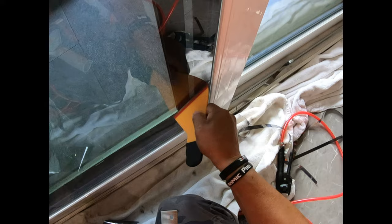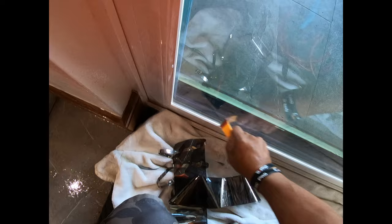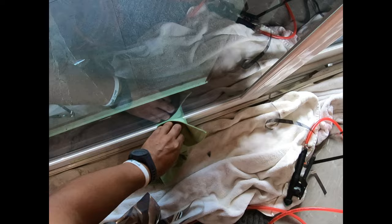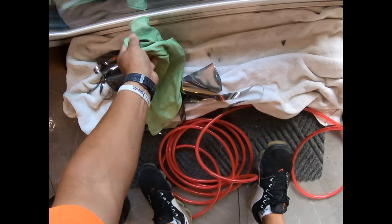My assistant, who is constantly in training with me, I decided to let him do this window on his own — he did the other one on that side over there so he's training and he'll become very good. The tips here: absorb the water with the rag, do the bottom slowly, and remember water is going to keep running from the top down, so keep an eye on this and keep doing this so it won't pick up sand into your film and ruin your perfect installation. That's it guys — hope you enjoyed it, like, share, subscribe and follow, have an awesome day.